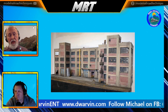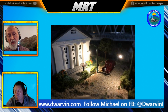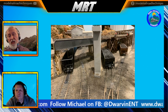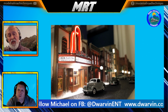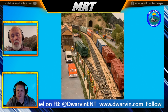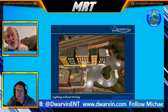So for example, there's basically a little light that would be down right next to the rail. And that little Lamplighter flasher unit now allows us to turn on signals based upon detection. So we can turn red or green very simply using those same infrared detectors. So you can use that same box. My next design is to build one that's a little bit taller, so that it's more at the height of the train driver.